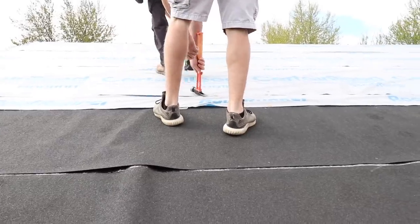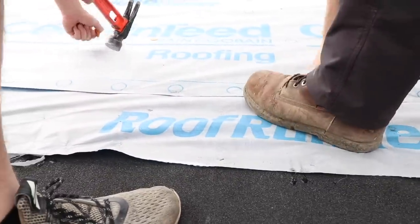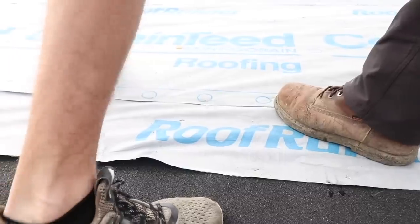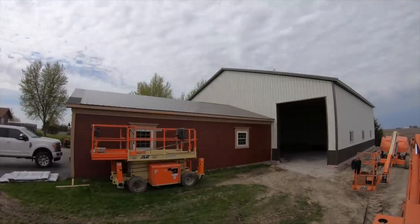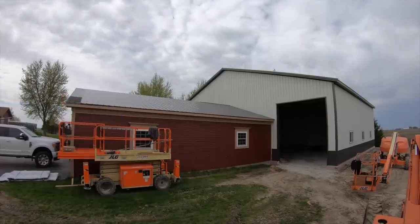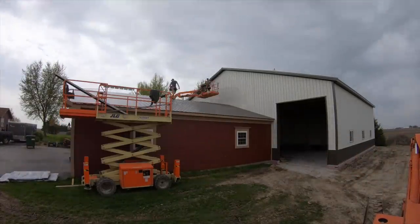What we're doing right now is the customer had this old shingled roof torn off, and we went ahead and put steel on it. But the contractor used button caps, and this is a great opportunity to share with you guys — you don't want to use a button cap underneath a steel roof because it will bleed through. You will see these protrusions through the roof. Definitely just lay your synthetic felt or ice and water, staple it down as you go, or pull the button caps before you roof.